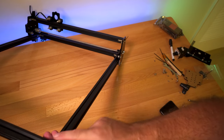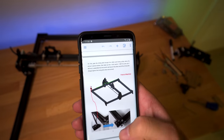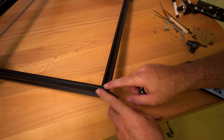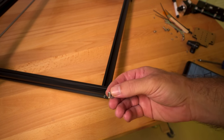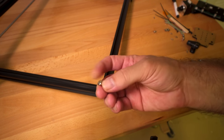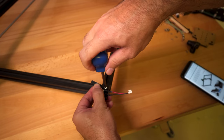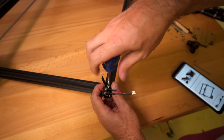That side's done — the belt is tight. Step 10: we need to install the end stop switch. This thing has two purposes — it acts like a switch and it also tightens the belt. We're working with the last corner in the back. We need another slide-in nut. Grab another bolt, take our belt, put it through this hole here, and the bolt literally goes right next to the belt and to this nut. We want to flush it with the end.